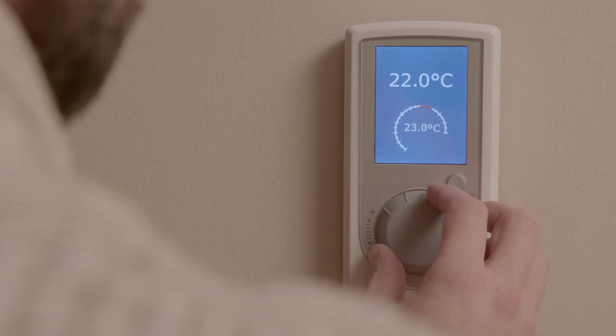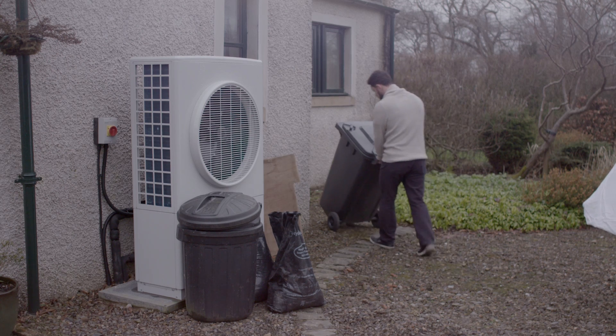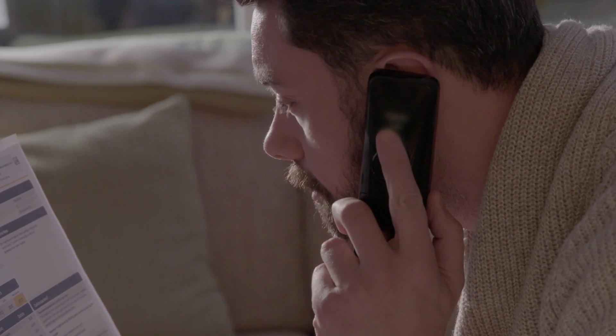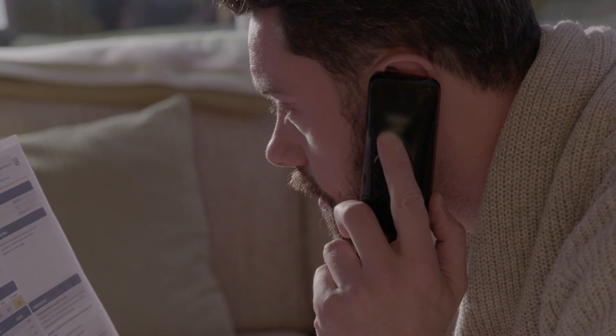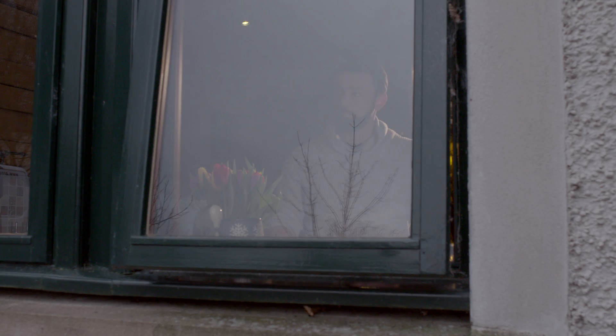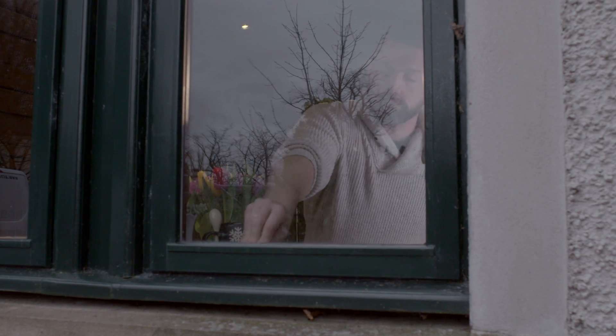To recap, to get the best out of your air source heat pump: get to know your heating controls; check the heat pump is not obstructed and the system pressure is correct; contact the installer or landlord if you're unsure about adjusting the program with the controller; check you are on the best electricity tariff; ensure your property is well insulated and close doors and windows to allow heat to build up. Small reminders, a simple plan, and talking things through with others in the household will help you adopt more of those behaviours that will ensure you get the best use of your air source heat pump.